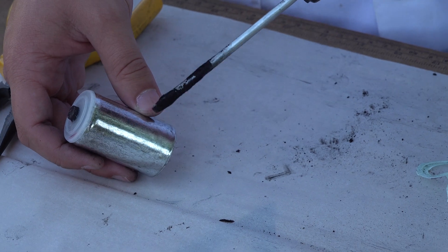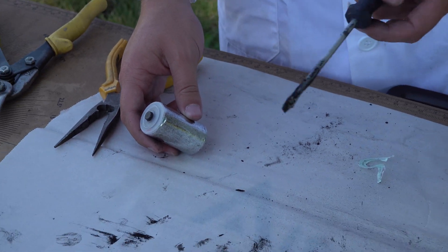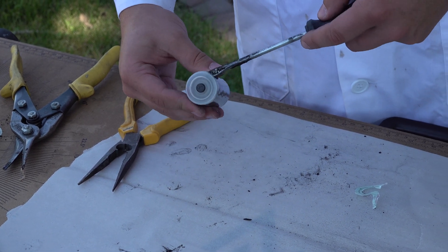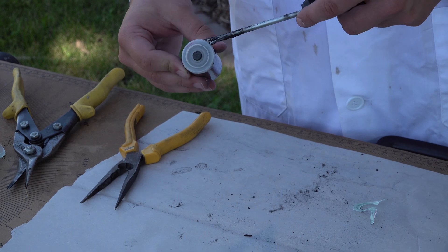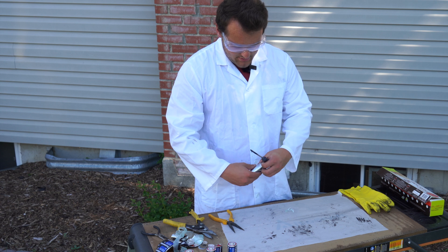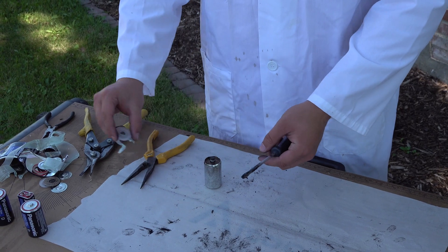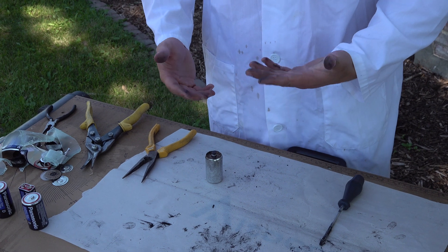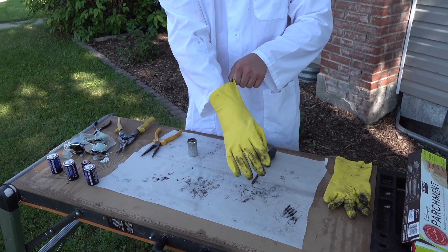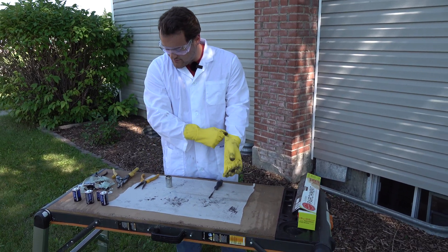The metal here is the zinc in the zinc carbon battery. It is responsible for the reaction that occurs to generate the electricity. But up here is just a rubber gasket, which you can peel up and wiggle off the center. That is also garbage you can set aside. From this point, as you can see, I already have stuff on my hands — it's not toxic so it's not a big deal, but it's kind of a messy thing to work with, so I'm going to put gloves on from here on out.